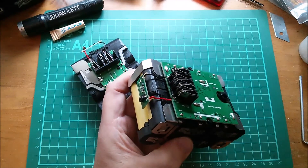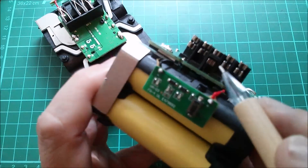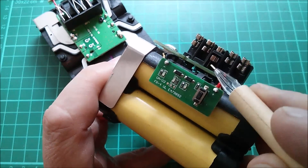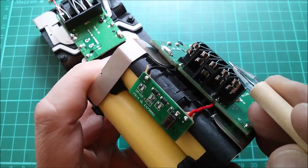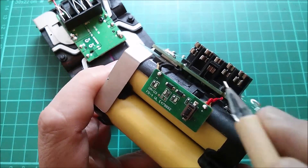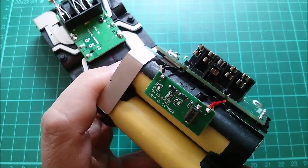The drill driver on the double-size battery puts the two battery packs in parallel and seemed to completely ignore the ID pin - that's the lower connector on this pair. The top pin appears to be temperature. The tool seemed interested in the temperature of the battery but not the ID pin. So is it the charger that looks at what's on that ID pin?